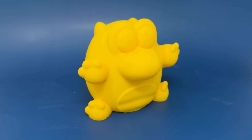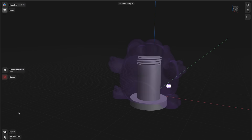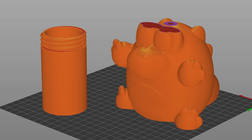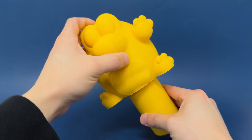Option three is a part printed with default settings — no special pauses needed — and it weighs less than a pound as-shipped. The secret is a custom template where you remove a negative cavity from inside your part, then print a separate external piece that fits that negative. You fill it with sand, ball bearings, or whatever you like, pack it tight, slide it into the bottom, and screw it in. This template is available through the links below so you can subtract the threads and cylinder geometry from any model.